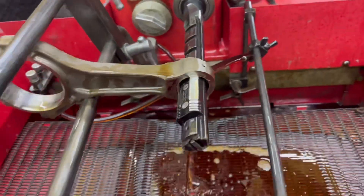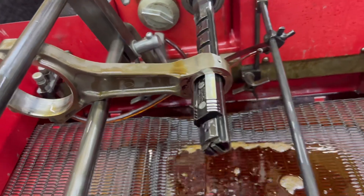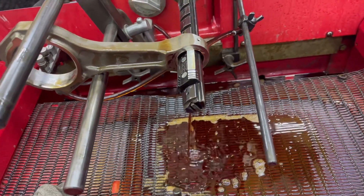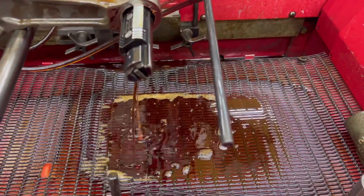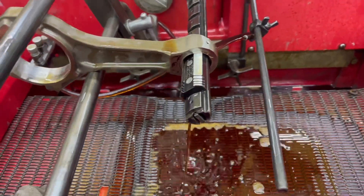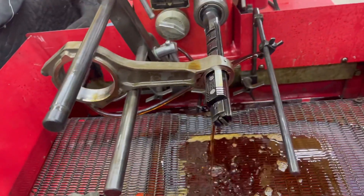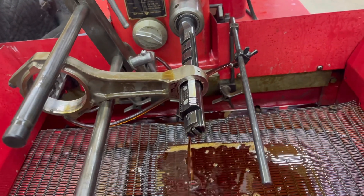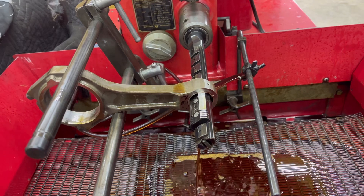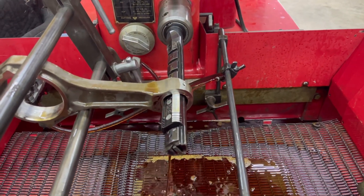That's just another added benefit for me to go ahead and go to the synthetic coolant. I would just about bet that that end of that rod is gonna be stone cold if I use water-based synthetic coolant — just like in the honer. It's hot, so I'm gonna have to hone it, let it relax, let the temperature come down so that I can size it. We don't want to size it when it's freaking hot. I do not understand why anyone would want to use this oil — it just lets it get so hot. We have synthetic coolant; I am using diamonds. If we don't have to wait for it to cool down, why do we?